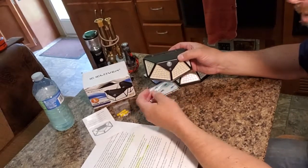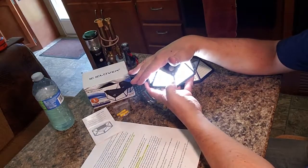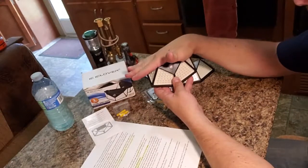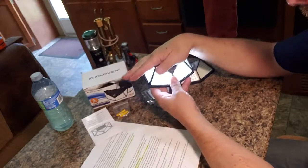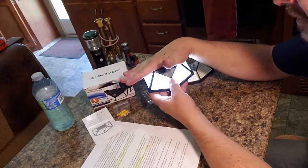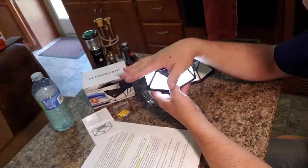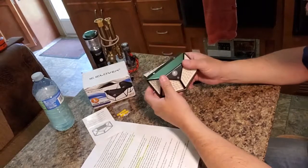Mode three is basically a garden light mode — a bit lower output. You can see a small amount of PWM in the camera because it does have a slight PWM, but it's not really bad. In this mode it draws very low amps from the battery, and runtime testing gives it around seven to eight hours before it shuts off. Another click turns the light off completely.